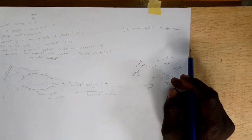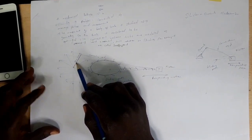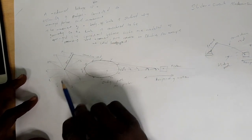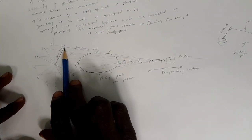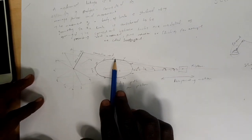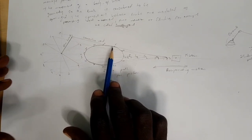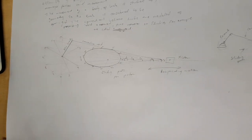An elliptical circle is going to form around this side. For us to start with the drawing, first we draw our crank, and the crank has a diameter of 13mm. The connecting rod will have a distance of 13mm, and it is being pivoted at 65mm. Now let's start drawing.